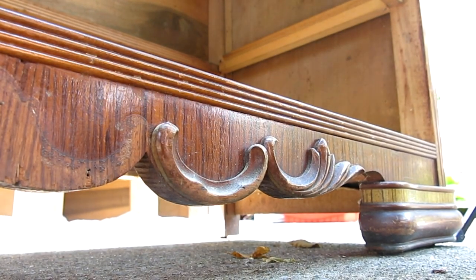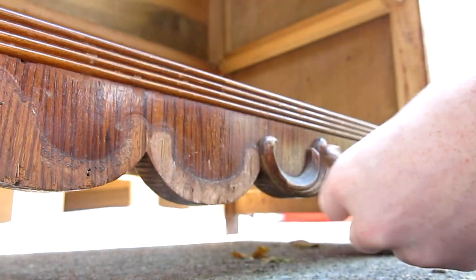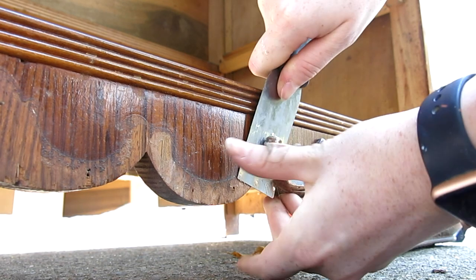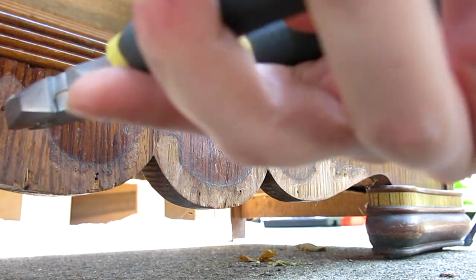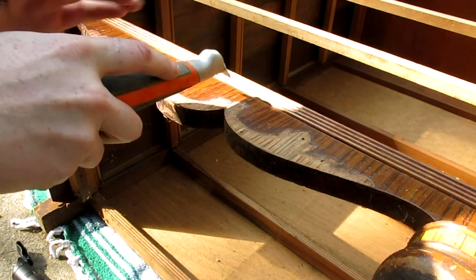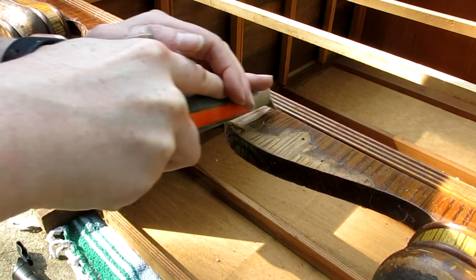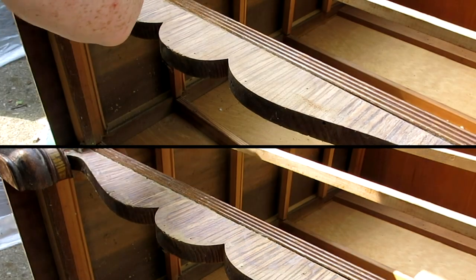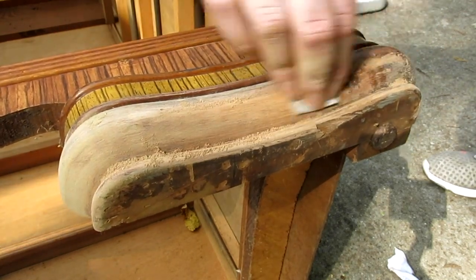My last bit of repair is going to be along the bottom of this dresser. It clearly had this beautiful ornate piece that went all the way along the bottom, but this little left detail was missing and there was no way I was going to be able to find something that matched, so unfortunately these pieces needed to go. I just used my putty knife to gently remove them and then removed any nails that were still sticking out. I removed the finish with my scraper, sanded everything back, and applied mineral spirits. I also decided to repair the feet on this piece, using 120 grit sandpaper to remove the finish from those curved edges.